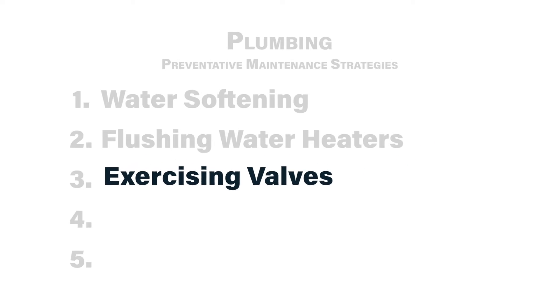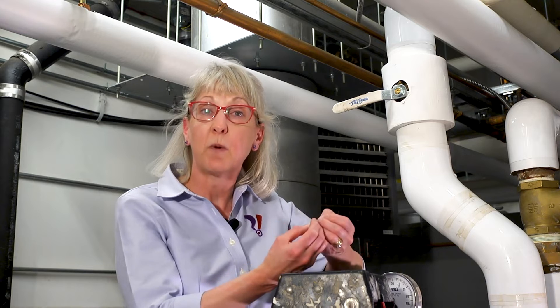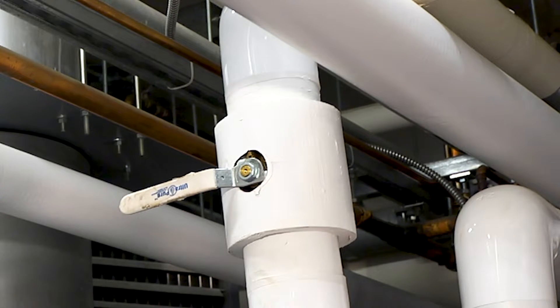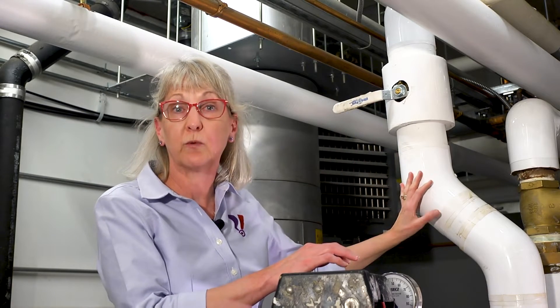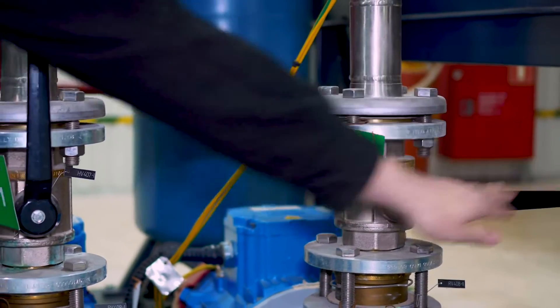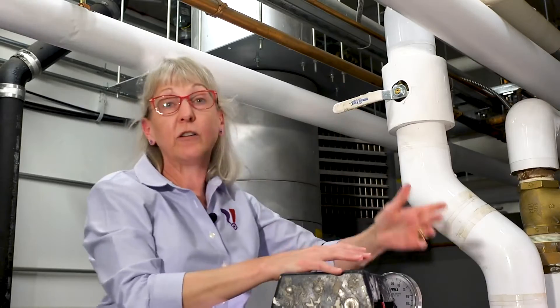The same scale that builds up inside your boilers can also build up in the rest of the piping system. It can wreak havoc on check valves, strainers, isolation valves, and essentially any piping component that has small pieces and parts or small orifices. One example is isolation valves. This is an isolation valve to one of our domestic water boilers. The isolation valve is here to stop flow through the boilers when the boiler needs to be maintained, but you still want to have domestic water service to the building. If these valves don't close fully, you won't be able to achieve that, and you'd have to shut down your whole domestic water system just to service the boiler.